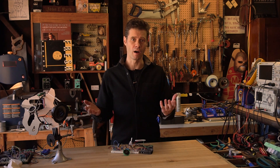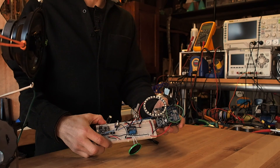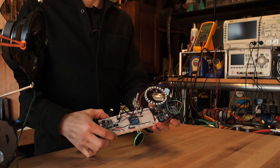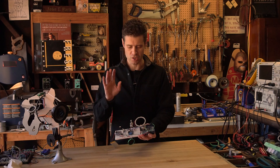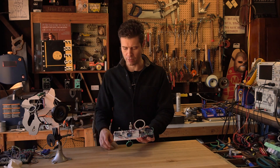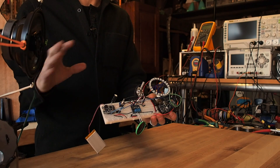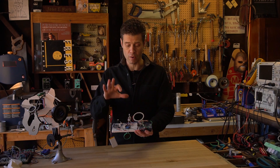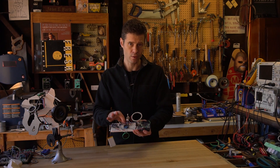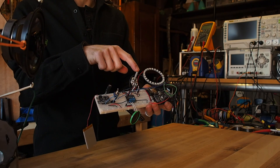So we had the lights and the music both running on an Arduino of their own, and those can be combined into a single board. Here we have one Arduino and it still has the music maker shield on top, but it also has the NeoPixels plugged into it. The system takes power from a lithium ion battery through the boost converter. We have a smoothing capacitor to keep any NeoPixels from getting blown up with a voltage spike, and audio coming out of the MP3 shield runs to a 3.7 watt stereo amplifier. The volume of that is controlled with a stereo audio potentiometer.